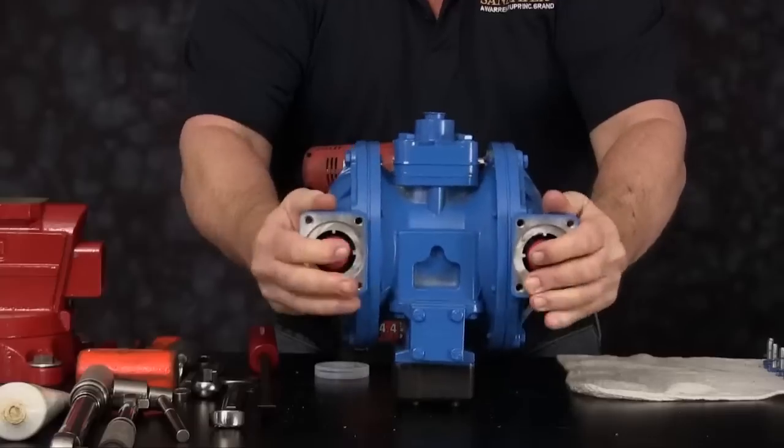Once aligned properly, you can remove the cap screws from the opposite side. Now we are ready to install our outer chamber. Inspect the outer chamber for casting integrity. Inspect the machine faces and radius of the chamber for damage or material buildup. Scarring, scratches, or material buildup can be cleaned up using emery cloth, crocus cloth, or fine sandpaper. The discharge side of the chamber should be up towards the serial number plate. Install the eight cap screws to secure the outer chamber into position.